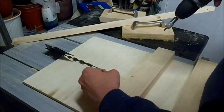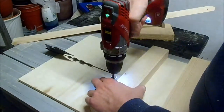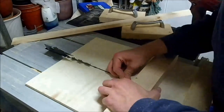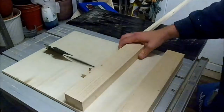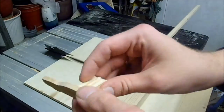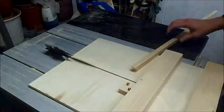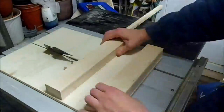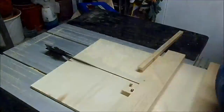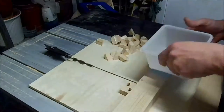I had built that sled for making wooden snowflakes last Christmas — I'll put links to those videos in the description if you're interested; there's one from Steve Ramsey and one from these woodworks. To make the process easily repeatable, I took a scrap piece and screwed it onto the slat to act as a depth stop, so I could use it to align the slat. I had to turn it upside down with every cut so both angles are on the same side, and the angled depth stop was a great help.